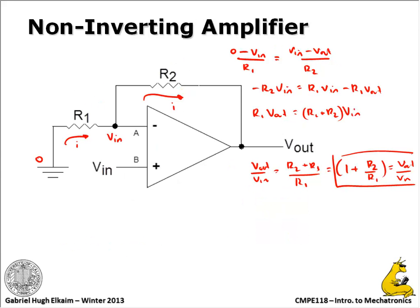Okay? And the other thing is, let's look at the corner conditions. The nice thing is, because Vn is going straight into the positive terminal of the op amp, it means that this is essentially a current wall. No current can flow into the op amp. So this is a nice impedance wall. So no current can flow through, so you're not loading whatever's upstream of V1. All right, so if you have a sensor, for instance.